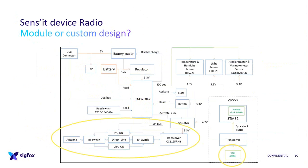So, for example, a TCXO is one that is constant in temperature. But for us, it was just a quartz, so moving in temperature. And what we finally had to do is push a thermal pad, like a sticking plaster, on our PCB, to maintain the same temperature on the MCU, quartz and transceiver, to be sure there will be no drift. So without changing the hardware, we had to add something on the BOM and on the protection. But it was less expensive than doing a totally new thing. And we had no space on the PCB to add the TCXO, of course.